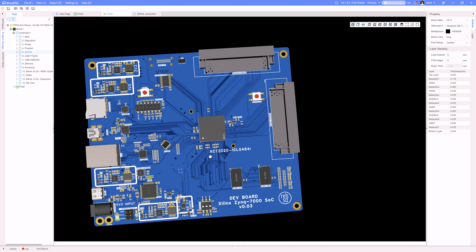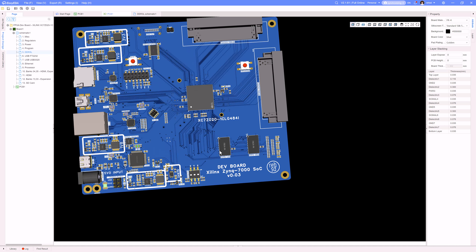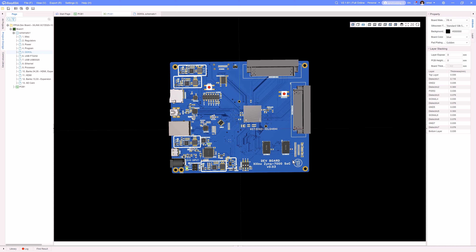A lot of the other I/O that's not being used for onboard stuff is going out through the 68-pin connectors, but there are still a lot of signals I'm not using. This SoC has so many I/Os. For memory down here — this is routed but not yet length matched — I'm running all the signals across in a flyby topology: out of the SoC into one DDR, then into the other, then to termination. The distinct data lines have a separate set for each chip.